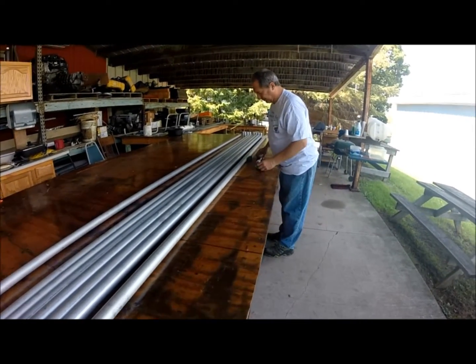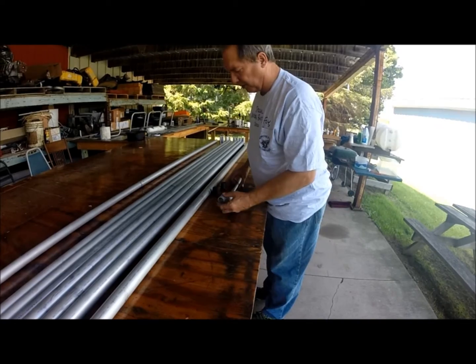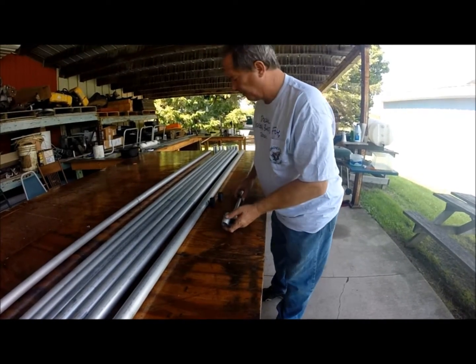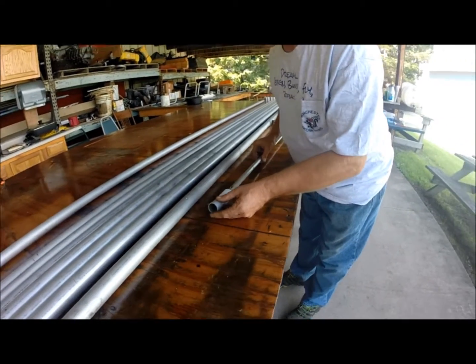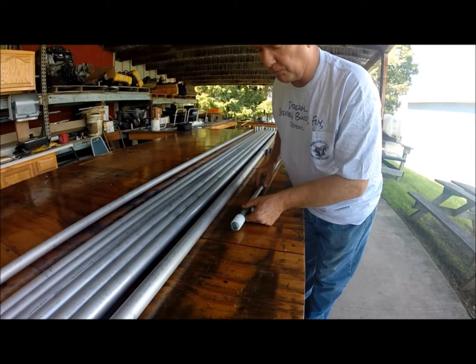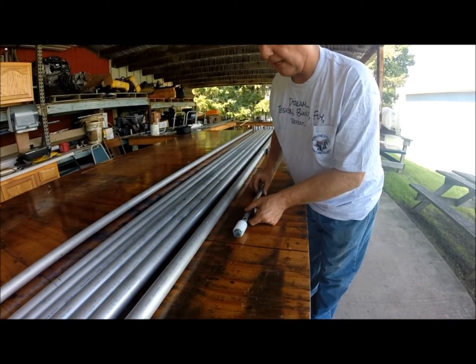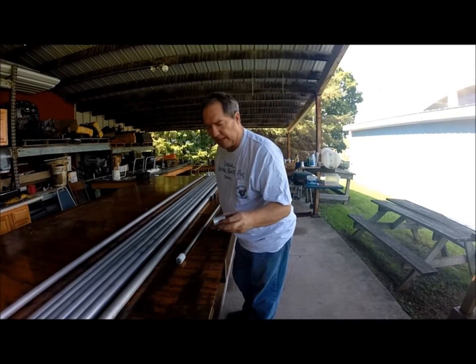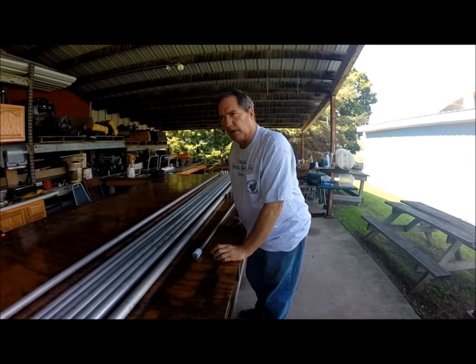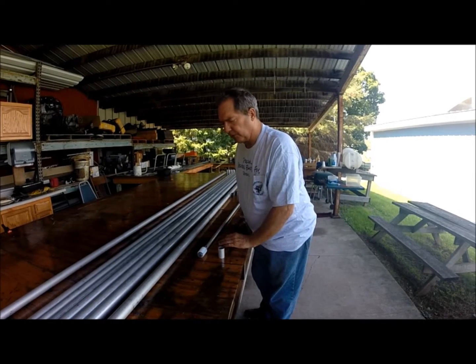The mandrels hold the doubler, and you push the doubler in up to a hole, and then you move it back and forth and turn it as the other person is putting the Loctite in. What we use for that is Primer M — we Primer M these and then mark a line around the middle, and then we use Loctite 680, which adheres really well.